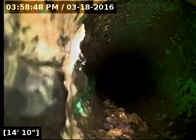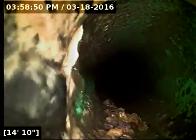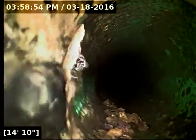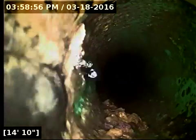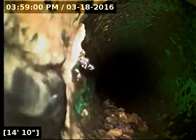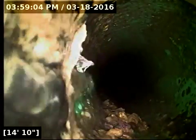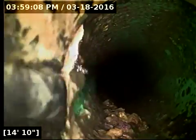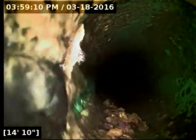Alright, so I located here, and it's right at the base of the front staircase. There's currently 3 little flowers right there, and the locator is indicating somewhere around 15 feet. It says it's very deep. There is a tree in the front yard, some other bushes. It's possible that roots have traveled over to this point and intruded through the line.